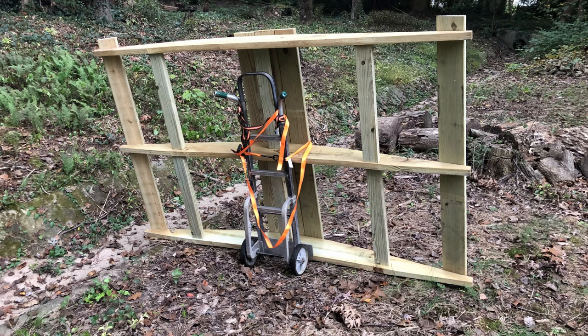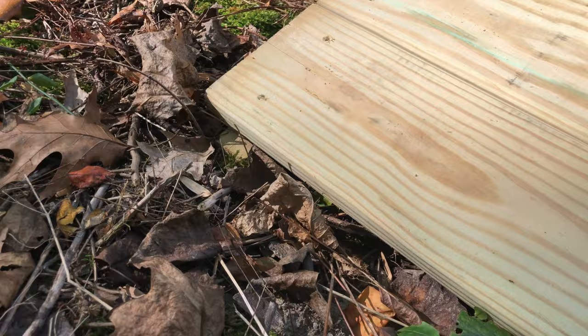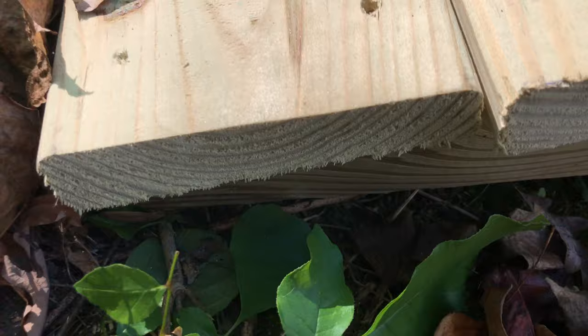Before you assemble the bridge, it'll be a good idea to know if you have help moving it. Wet wood is quite heavy — I think my bridge was going to be around 300 pounds, which I know for sure I'm not going to be able to move myself. If that's the case, I would take a hand cart and move the frame to the final assembly location, because once it's completely built, you might not have 3 or 4 friends willing to help you move it. Once outside, you do have to make sure the ground is prepared — you might have to level it and compact the soil to keep the bridge from moving, especially if you're going to be driving heavy equipment over it.